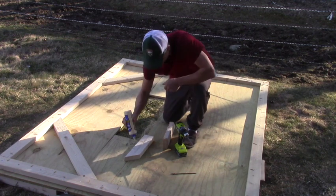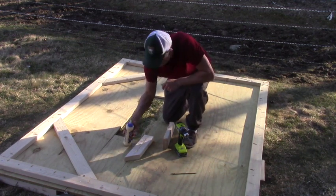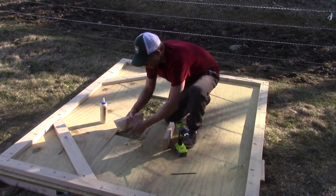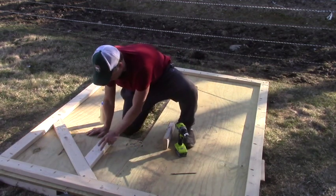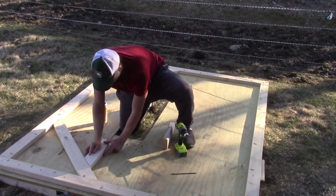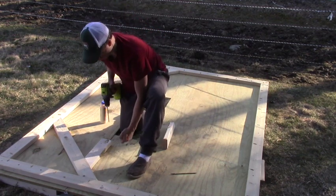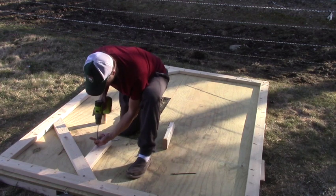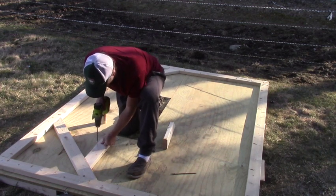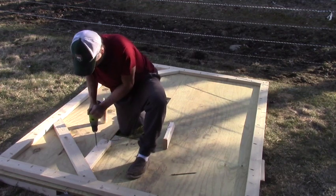This is not a necessary step, but I like to install a 17-inch horizontal support made from a 2x4 piece of wood. I secure this to the diagonal support beam that we previously installed. This will require a 45 degree miter cut as I demonstrated in the previous video. I will then use 2-inch screws to secure this horizontal support to the plywood on the other side.